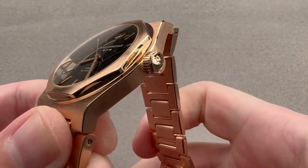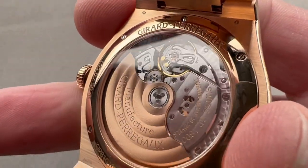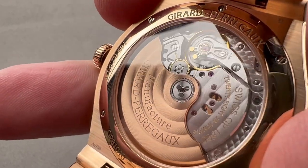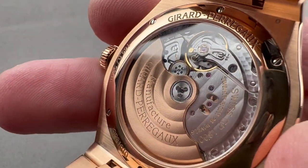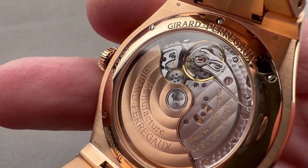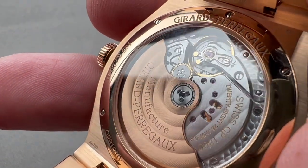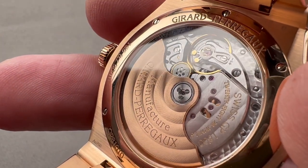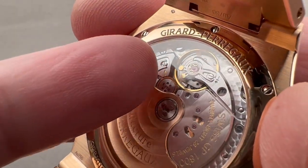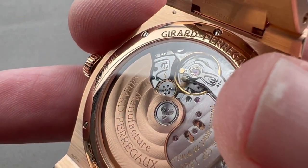Screwing the crown back down and flipping it over — this has the more upscale and more modern of the two Girard-Perregaux automatic movement families: this is the GP 1800. The older 3300 has a shorter power reserve and measures 26.2 millimeters; this is 30 millimeters, so it better fills the case back of a large watch. The 3300 has a 46-hour power reserve; this has a 54-hour power reserve. Of course, the stop seconds and quick-set date are included. It pivots on 28 jewels and beats at 4 hertz or 8 beats per second. There is an Etachron or Etachron-like arrangement for fine adjustment, and also an eccentric screw ultra-fine adjustment mechanism for fine tuning.